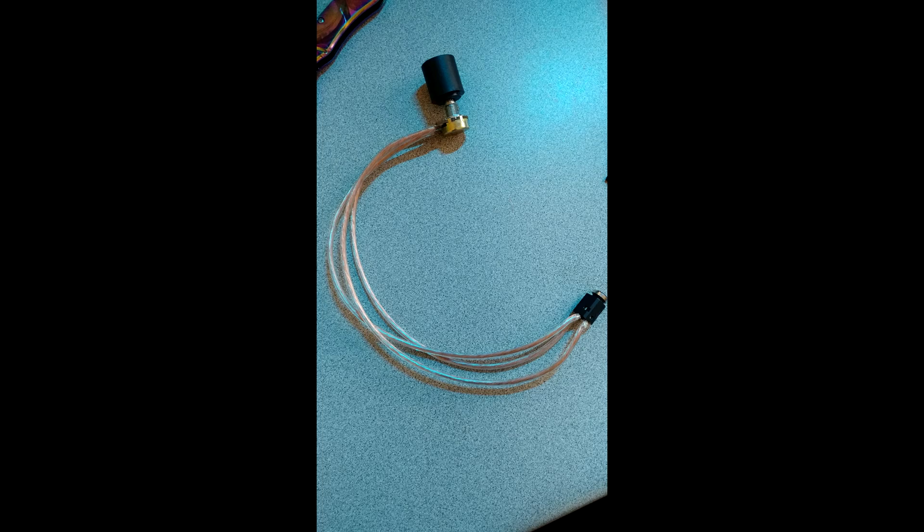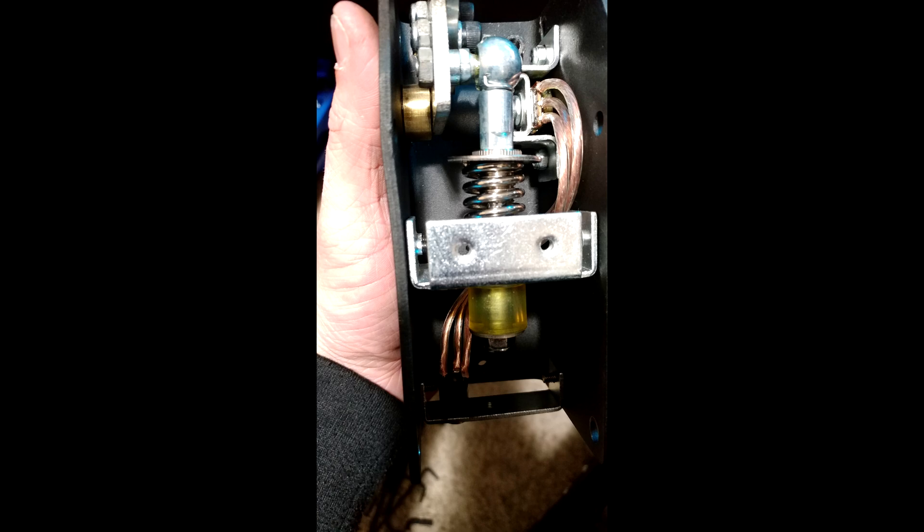As far as the wiring, I just used 16-gauge generic Amazon basic speaker wire. I didn't even strip the casing — I plugged the casing right over the pins and now it works better than it ever has. This is how it should have been done the first time. Fanatec uses these little cheap wires with one wire soldered to each pin, and the solder ends up breaking and the wires retract, giving you a loose connection where it just hovers and flutters around.